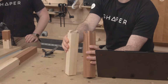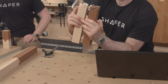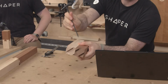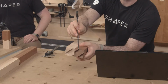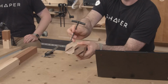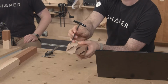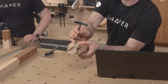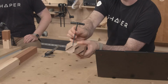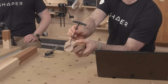And you'll note that if I look at this from the top down, the inside cut on this is actually giving me this bottom width because I'm using the width of the dovetail cutter set at 0 for the inside cut. We want this bottom width to match the top width of this dovetail. But if we're cutting based on this bottom edge and trying to get it to match this top face, we need to actually undercut that by the distance that that dovetail cutter protrudes, that angle that it protrudes.